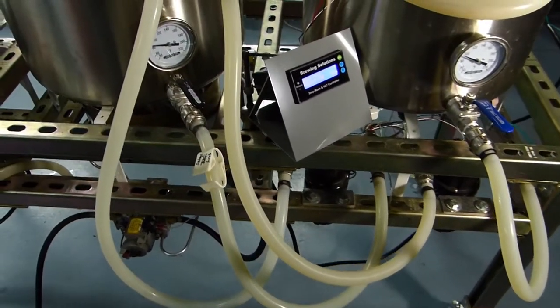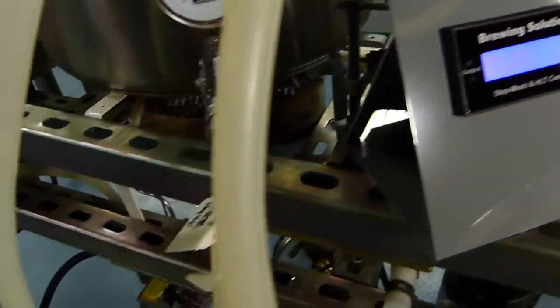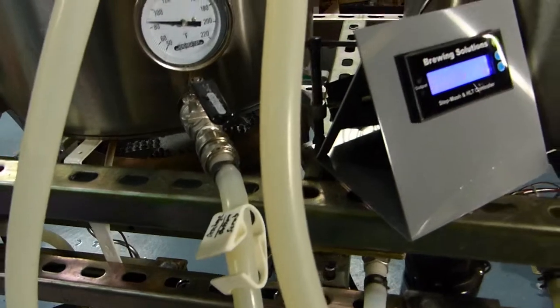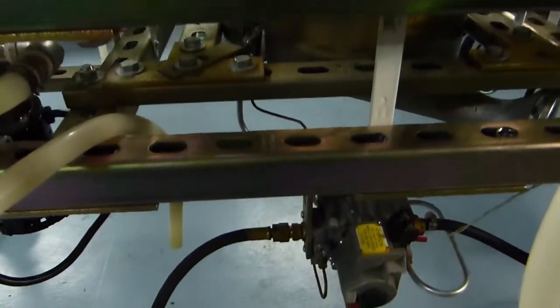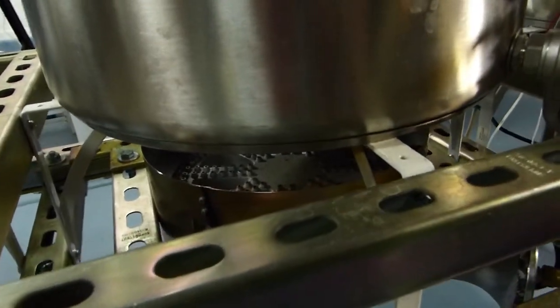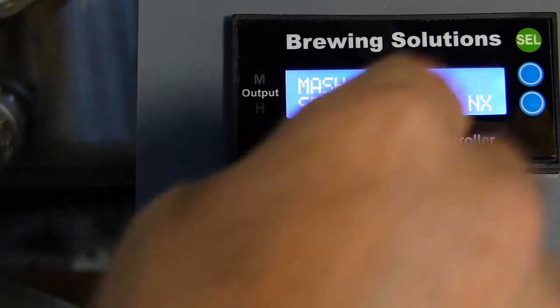The HLT sensor is located at the HLT recirculation pump. I've placed a step-mashing HLT controller at the bottom of the HLT so that I can video the controller and the burner flame at the same time to show how PID can be very effective with gas temperature control. I will now configure the system for HERMS operation and gas PID control.